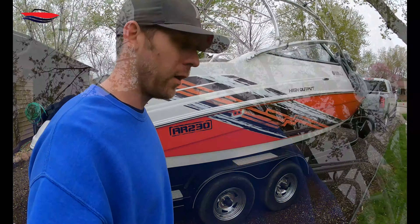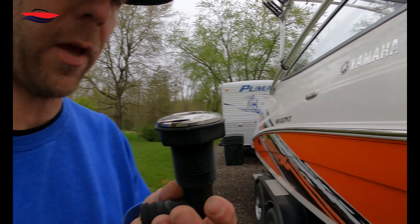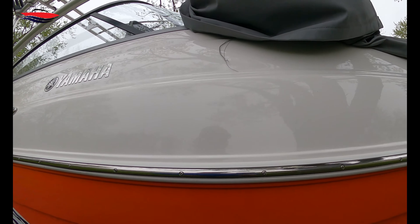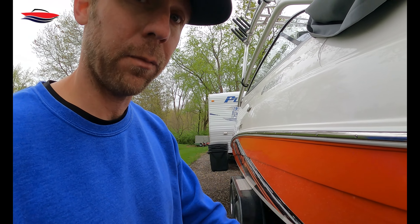What we're going to do is use these vent tubes — these through-hull fittings. These are from Wake Makers. These are the exact same ones they use on the Malibu. I've got three bags to vent, so up here below the rub rail I'm going to have three of these — one, two, three — that's going to be my vent. As the bags fill up, the water is going to get pushed through the vents and out here, and that's going to be my indication.